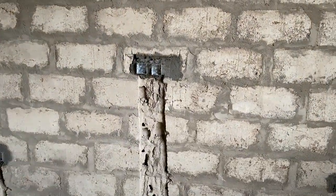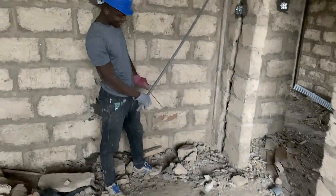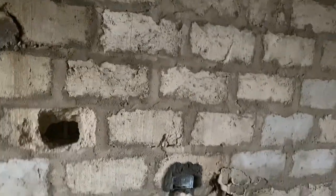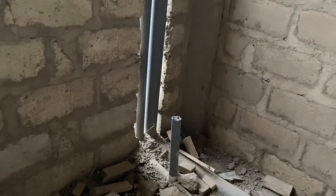This is the last floor. One of the things we did was to make sure that at least for every room, one socket was on a different breaker. The rationale is that if for whatever reason a breaker or fuse goes down for a room, at least in the middle of the night if you have one socket working, you'll be able to manage until the following day when you get an electrician. This approach is more expensive because you need a little more cable to do the additional run to a different circuit breaker, but we believe it is worth it.